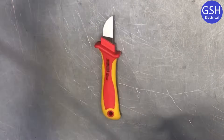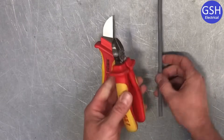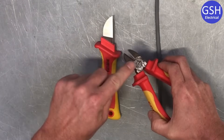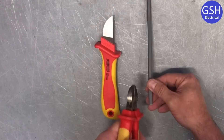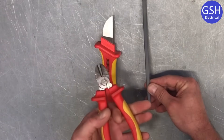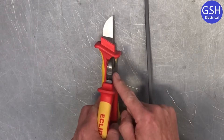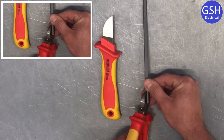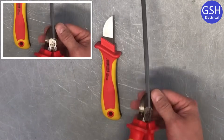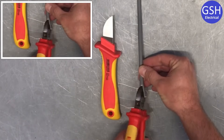I'm next going to turn the cable round and take my side cutters. This is quite important — we're just going to use the cutting action here. This is the bit my students find the most difficult: when they put it on here they're too excited about cutting into it and make a poor first cut. I usually make it look incredibly easy, and it isn't, to get it in the right position. Using the score line on the cable, put it in the center, take a moment to see it's fully in and dead straight before doing the cutting action.